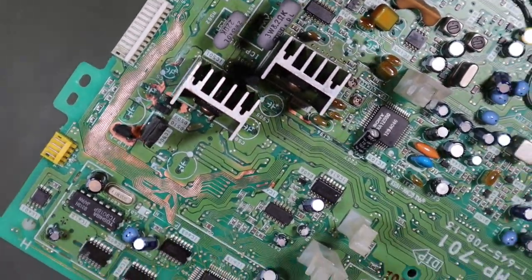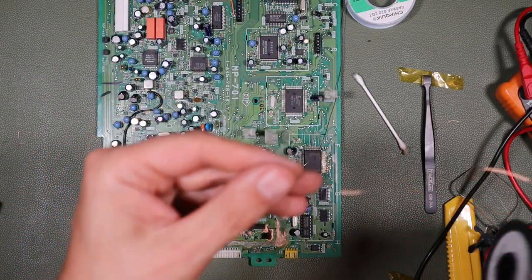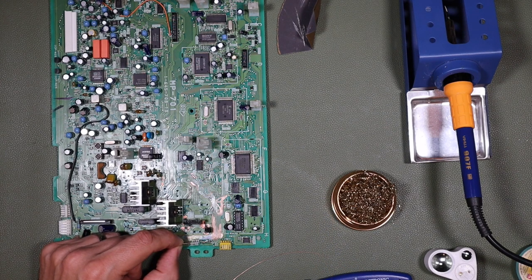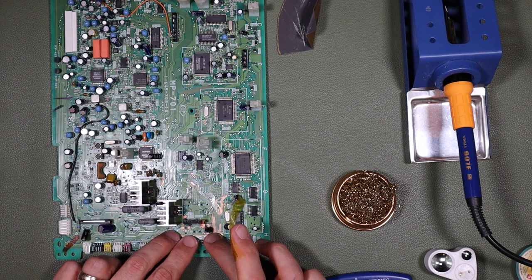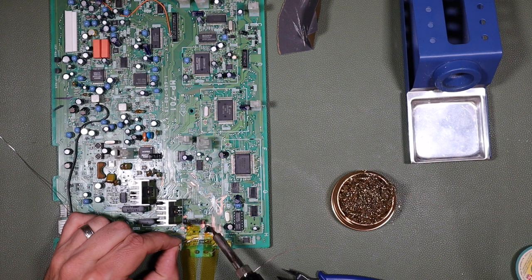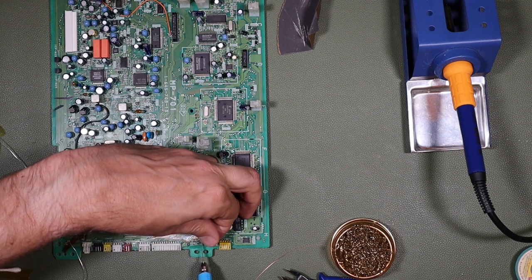What I found isn't good news — there was quite a lot of damage from the electrolyte that had leaked. There are a number of areas where there are breaks in the PCB tracks. These tracks run between the mechanism control processor and the connectors on the board, which connect the processor to the sensors and motors that control the mechanical components of the player. I've never repaired printed circuit damage on this scale, where the tracks are so fine and so close together, and I don't have a microscope. I set about doing the best I can, repairing the tracks with enamelled copper wire — 0.2mm in diameter, not much thicker than a human hair. I cleaned off the enamel on a section, cut it to length, held it in place with kapton tape, applied flux, and soldered it in place. Once cooled, I cut off any excess with a scalpel and moved on to the next track. All of this was too intricate for video camera, so I've cut in some still images.